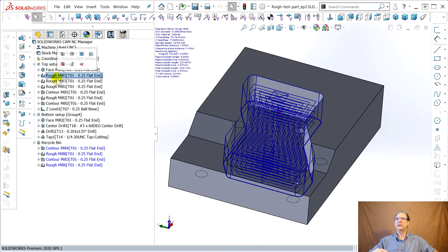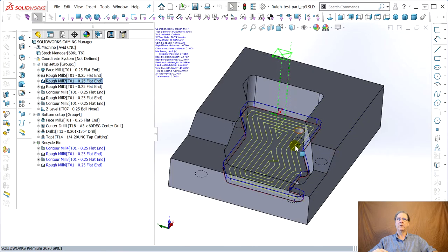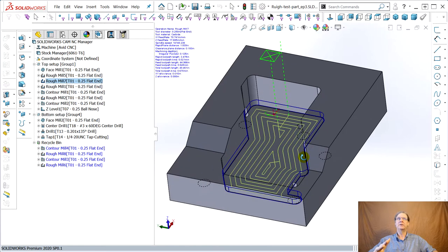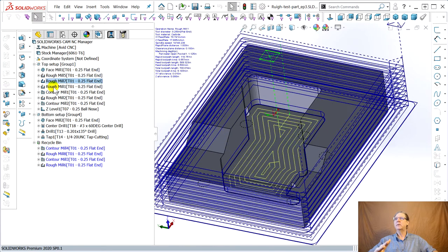Does the top pocket, does the bottom pocket, and what we're trying to do is this little face. I thought about, hey, why don't we just do one big deep pocket and use this as the edge, leaving a big chunk here, and then the second pocketing operation will just take that chunk. I just felt it was nice to have the machine be continuous around here so there wouldn't be a line going up to the edge. Dealer's choice, any way you want to do it.